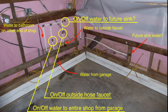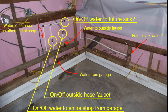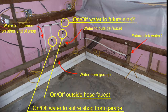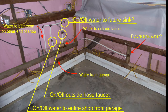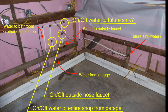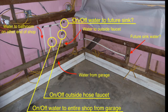Since the bathroom will also have a sink, I haven't decided whether to install one here as well. However, it's a lot easier to rough in a line before the wall panels go up than to pull them off later. A drain to go outside for that potential sink was also roughed in under the window. Each line has its own shutoff valve, and there's also one at the house and the bathroom. You can also see the gray electric wire that powers the path lights — the path light wire and water lines are all buried in the same underground trench. Both the wire and the PEX lines come up through gray plastic electric conduit, which I used as a shield when the concrete floor was poured. If the PEX or the wire ever have to be replaced, the conduit will make it much easier to pull out the original line without busting up the concrete floor.